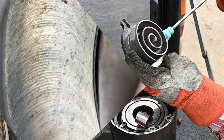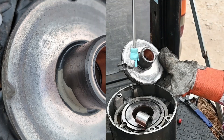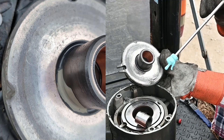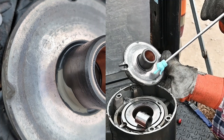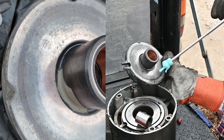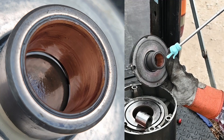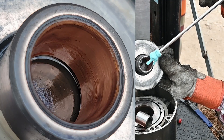Some of these really fine circles on this side are factory. If we look at the bottom side we also see signs of galling over here on the sides — that is usually a sign of refrigerant flood back. If we end up with low superheat or improper airflow, we get refrigerant flooding back to the compressor and it causes damage to the bearings farthest away first. Looking inside we do see some copper plating, meaning there was some acid in the system at one point. We also see a little bit of grooving right here, which are also signs of refrigerant flood back.